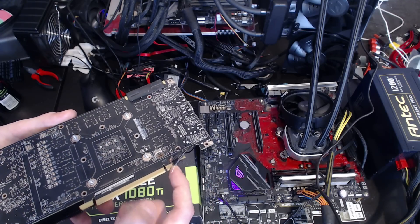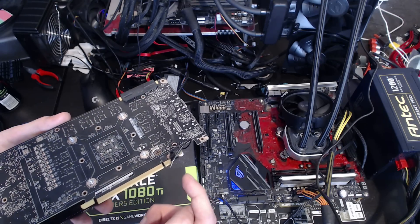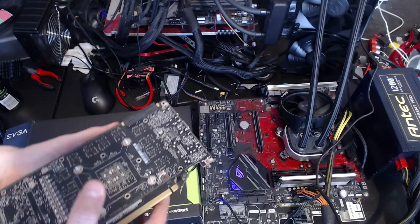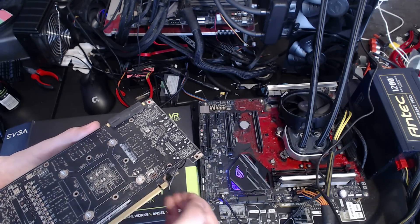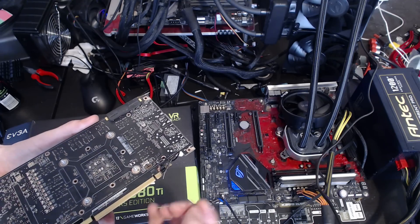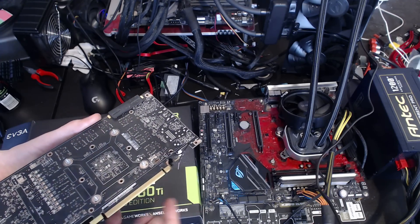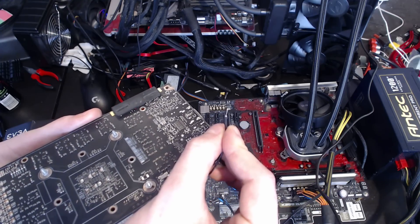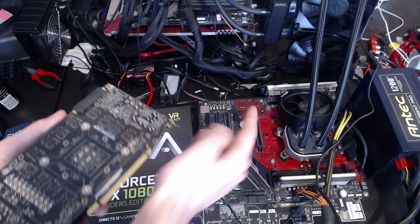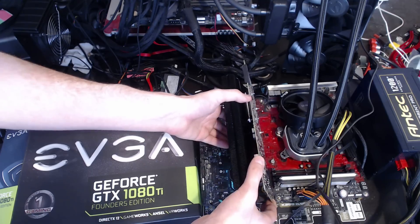The pins that are missing here — there's a couple of 12 volt pins that are gone and two ground pins that are gone. The grounds on the 12 volt pins: not a big deal, we have the bodge wire to supply 12 volts. But the bigger problem is there is a presence pin at the very first pin on this side of the card. What I had to do is trace what was left of that pin to a point where this black wire goes to, and that black wire now has a breadboard-type pin right here. So when I install the card, I plug this into the first pin of the PCIe slot on the edge closer to the CPU, and the card works.